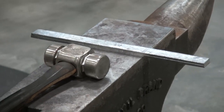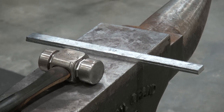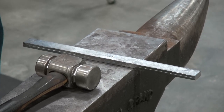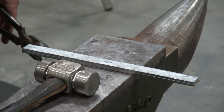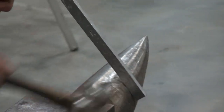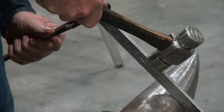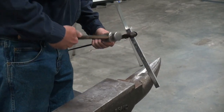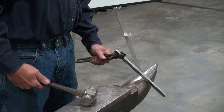The other thing is that through the course of building the shoe, I want to maintain complete control on that shoe at all times. I don't want something getting off — bent too much, bent too little. I don't want to have to back-fix it. If I come out for a toe bend and I go here and hit that, it's pretty tough to get your hammer to hit perfectly square on that shoe. It hits at a slight angle, and that causes the shoe not just to bend for the toe but also bend the other way — and that's a fix. I'm going to have to put it back up and fix it, and I don't want that to happen.